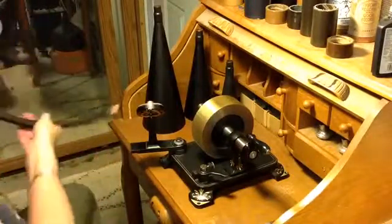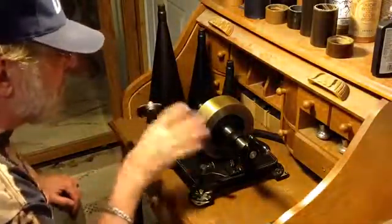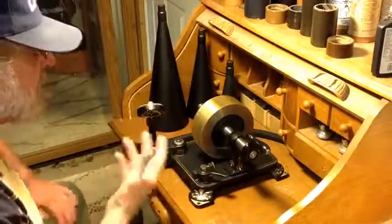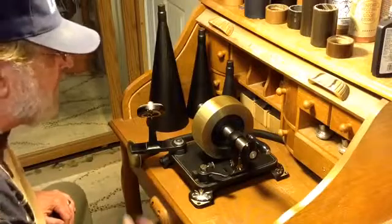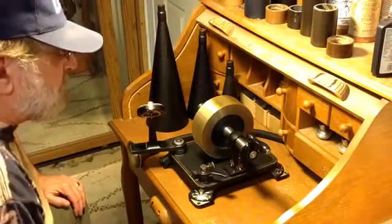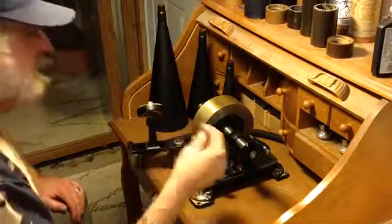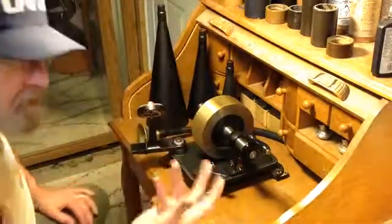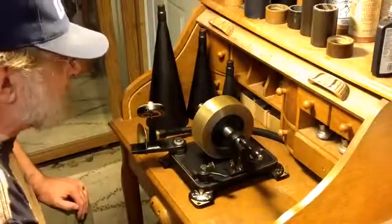And it's surprising. The recordings I'm making with horns are much deeper. They're much more defined, and yet they're as loud as a speaking tube. A speaking tube makes a recording that lightly indents the surface, but it's as loud and clear as a recording that I make with a 10-inch horn. It's somewhat consternating to see these really deep grooves and get X amount of volume, and then make a recording with the speaking tube and get these really shallow grooves with the same amount of volume.